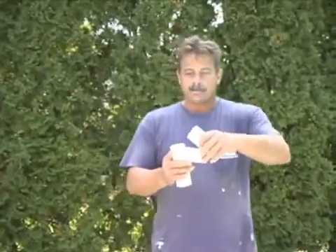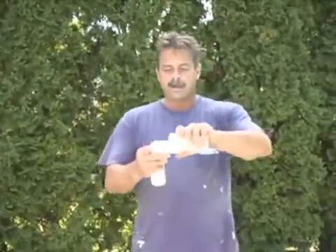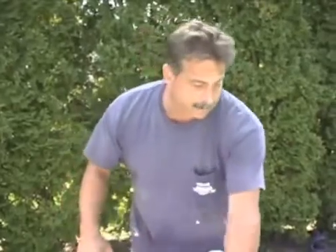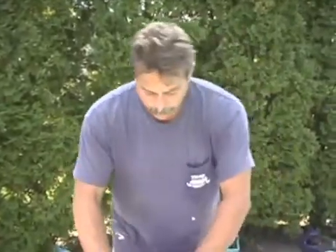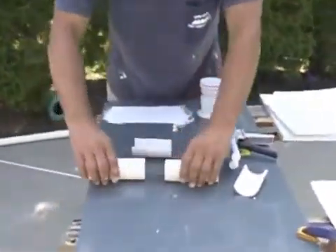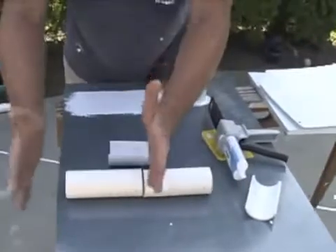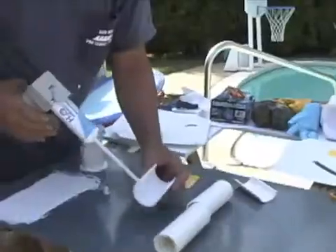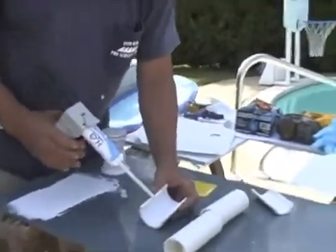Where that comes in handy is you can cut the section of damaged pipe out. You're not going to be able to get them apart from each other, but you can cut two couplings, put a spool piece in the middle, and slip the cap up on the bottom with this material embedded in it. We've already prepped these pieces — we have the two pipes out from each other. We're going to cut the damaged section out, simulating doing one repair per side.